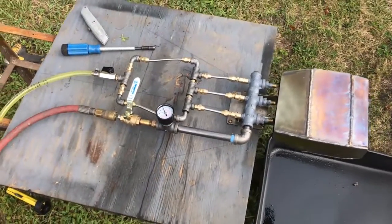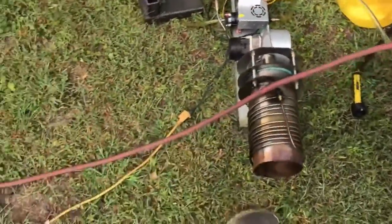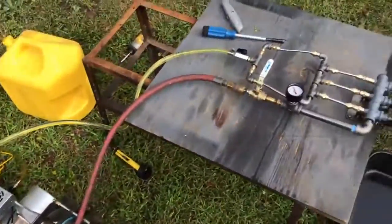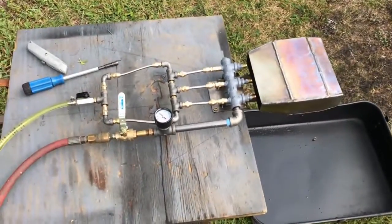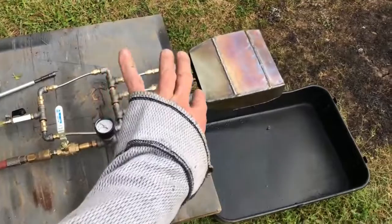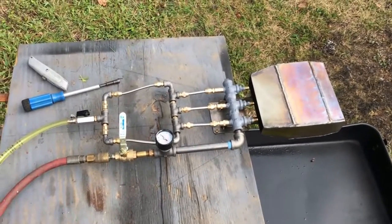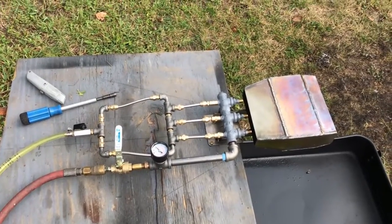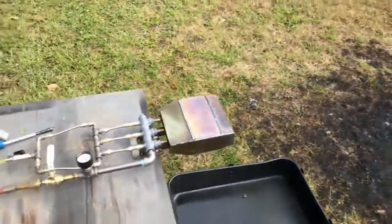It's unbelievable — one-inch air line. If you're using plant air at 80 psi, a simple hose like this just isn't going to cut it. You need every bit of a one-inch air line — and by one inch, I'm talking ID. Just to supply the flow this bad boy needs. Plant lines are usually 500 feet long or something crazy, sometimes longer than that.